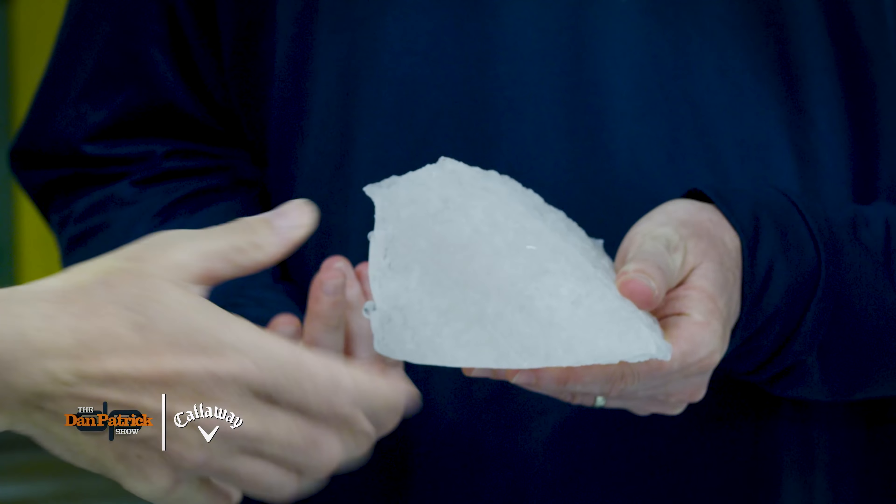So this is where we decorate the ball or stamp the ball. The ball gets loaded in, and as the machine works its way around, those ink cups slide, exposing the ink to the pad. The pad will pick it up and transfer the ink to the ball right here. In between these towers are UV light — if you expose the ink to UV light, it cures immediately so it doesn't smear. That's it. Finished.